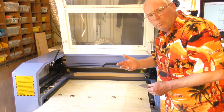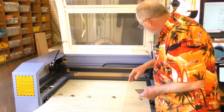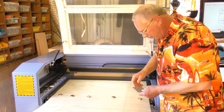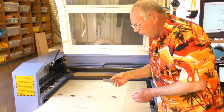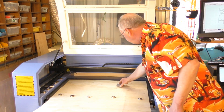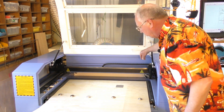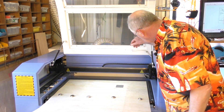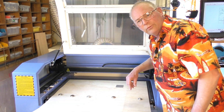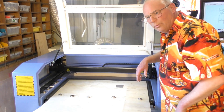The way it operates is, on the back of the nozzle there is a proximity sensor, and there's a piece of steel plate that's rubber-coated. You just pop it on here like this, drive the head over it, and ask it to self-level and off it goes.